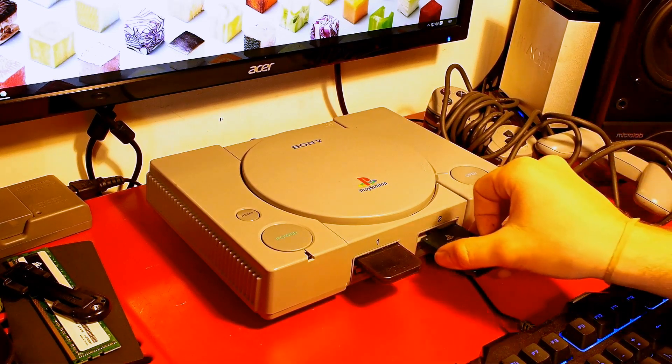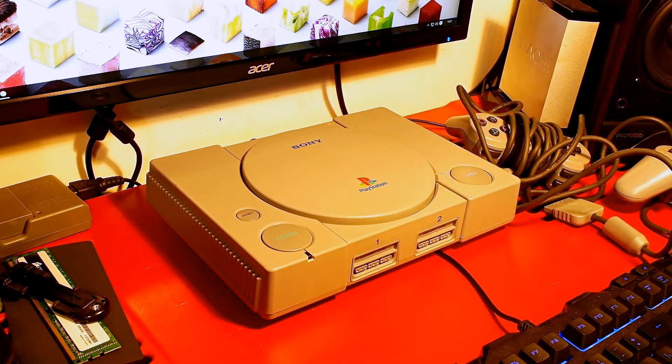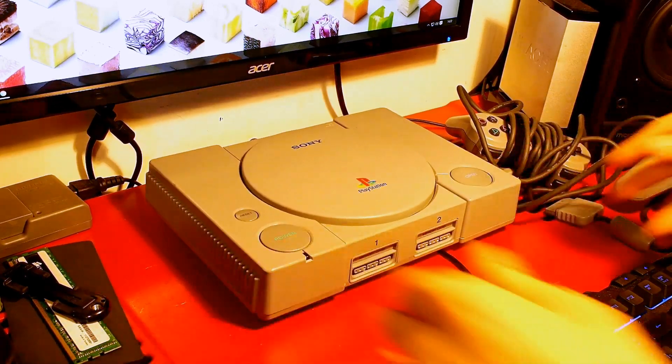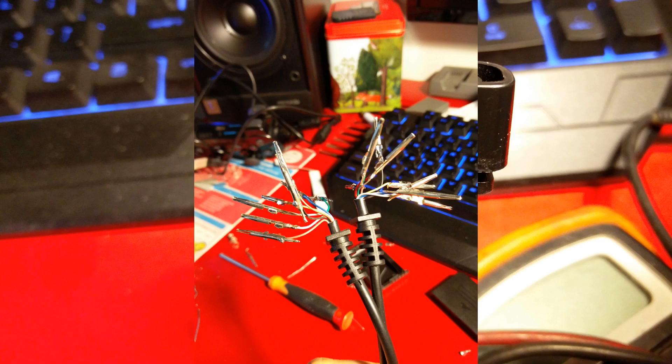The other side I did want to do, but with the space where the Raspberry Pi was, it's just not possible. So what I did for the controllers — you can get pretty cheap, simple USB to PlayStation controller adapter things. I just dismantled one of those and rewired it into the back, and basically soldered all the pins to the back of the PlayStation ports there. There were nine pins — you just replace those with the ones from the controller adapter, and then you can literally just plug it in exactly the same.